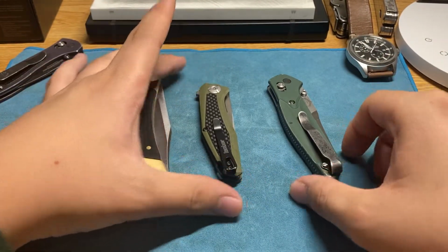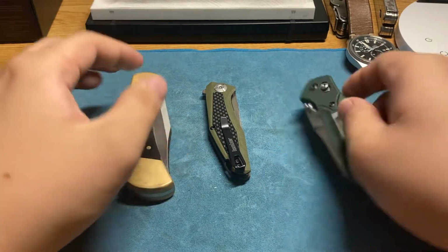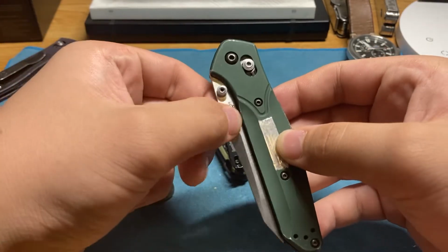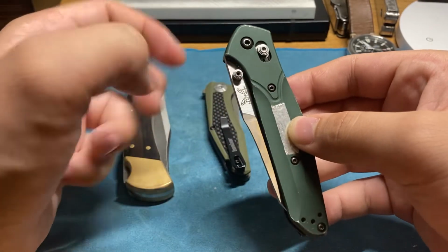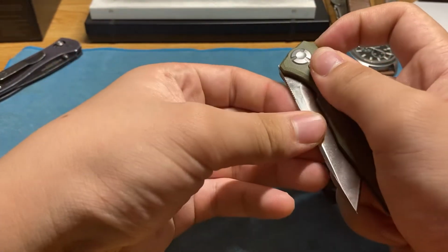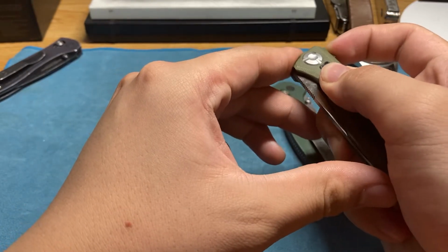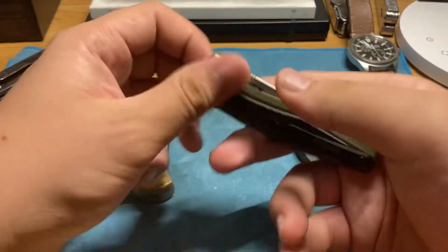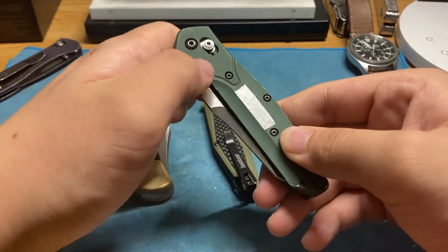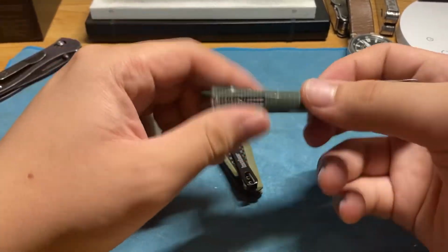Now, there are different kinds of detents, and there are two broad categories. The sort of detent that I was talking about earlier sucks the blade back in to a certain point. Like if I let go here, the blade gets pulled back in. And there are detents that do not do that, which are more like a singular point at which you overcome it, as opposed to a gradient of sucking power. It's hard to explain, but you'll see what I'm talking about as I get into it.